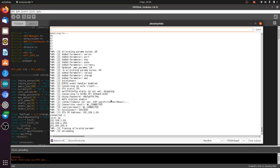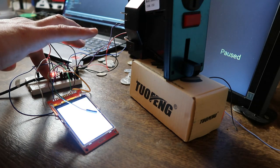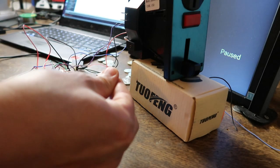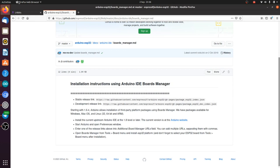If I flash it again, this time at the beginning I'm going to hold that capacitor wire — GPIO 15 — then it's going to trigger the portal so we can change some of those credentials. Sometimes it can get crossed when you have the serial monitor open while uploading, but I think I've gotten away with it. When it starts displaying those numbers and I hold that down, you can see it says 'Settings Erased' — it's wiped everything off the ESP32, destroyed that config.txt, and opened the portal access point.